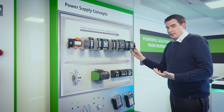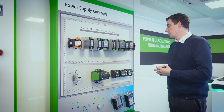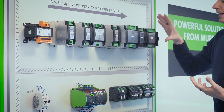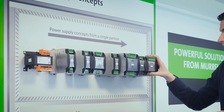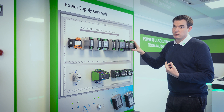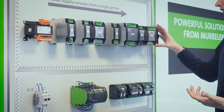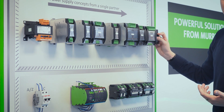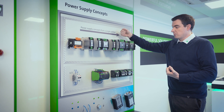This gives a realistic capacity reading for the battery. We can supply batteries, or supply you with a temperature sensor to integrate into any third-party battery. This is focused around keeping the system alive as long as possible. When configuring through the micro USB port in the software, you can set the conditions at which the battery OK alarm becomes active. The batteries use an automotive fuse — because if the worst comes to the worst, you've always got one in your car in a pinch, rather than digging around for a glass fuse that may be broken.